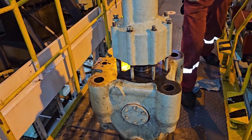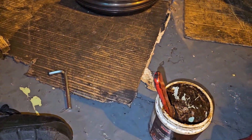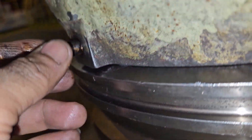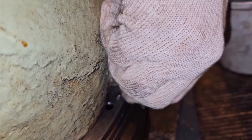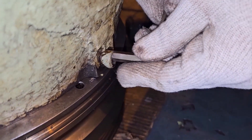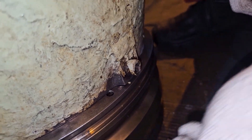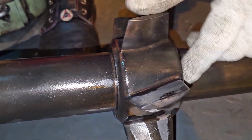Next, you need to take out the oil cylinder. Then fix the locking key — it's an allen bolt — so that the allen bolt holds the exhaust valve seat along with the exhaust valve cage. Always use copper slip for the bolt so that when you are opening it, it doesn't give much problem. Use a proper allen key so that the allen bolt head is not damaged.